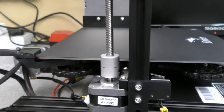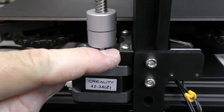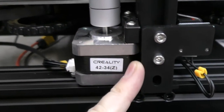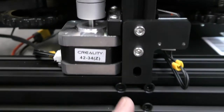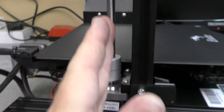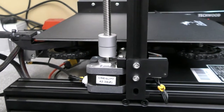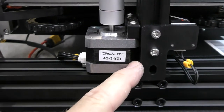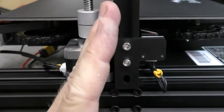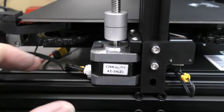The whole thing has to come out — it's probably only a millimeter or two out. Somebody has made a printed piece: you take the two screws out here and the two screws out there, and the new printed piece has a built-in washer — a sheet about a millimeter thick — that goes down the back of the motor. That brings the motor out so it's nice and parallel with the bar. You could just put washers behind it, but a sheet of plastic is better so all parts of the motor are touching and it can't twist in or out.